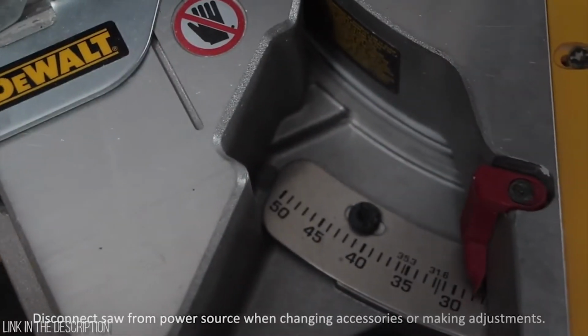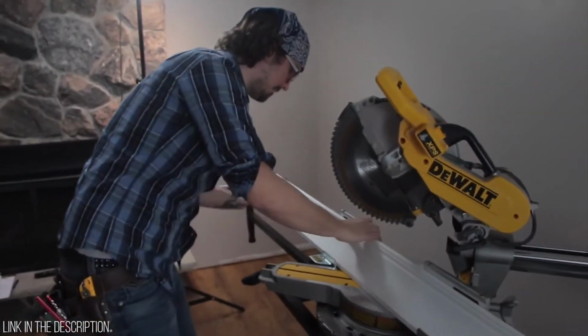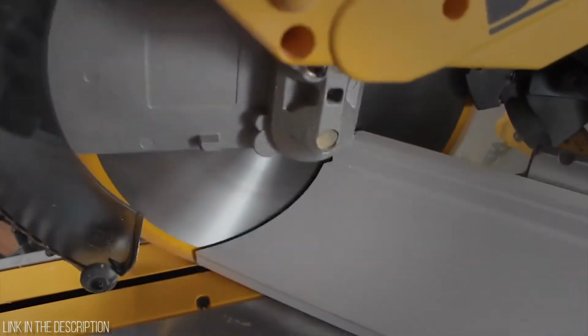Set your saw to the degree you locate it on your SAWSET. Place the molding with a detailed or small cove on the upper side of the fence. Follow your saw's safety manuals and cut.